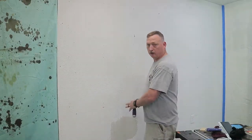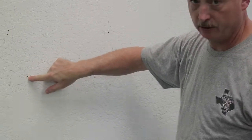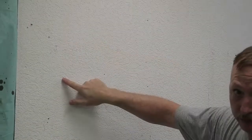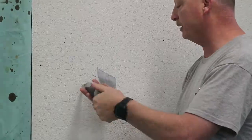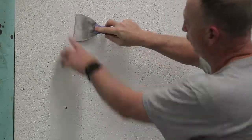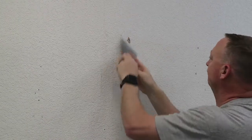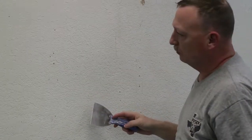We're letting our patch dry, and now I'm going to fill in the little holes on the rest of the wall. This here is an anchor - you can see it - we're going to pull that anchor out. Up here we've got a bigger hole and some globs. I'm going to use a flathead screwdriver to pull the anchor out - for other types of anchors you might need a drill and drill bit. Once that anchor is out, take a putty knife and go over the wall where globs are and smooth them out, then fill those spots with joint compound.